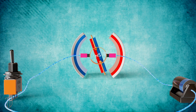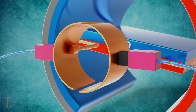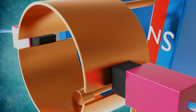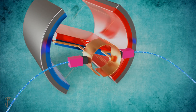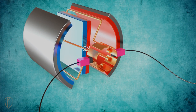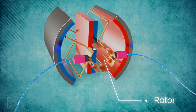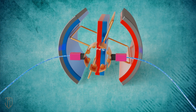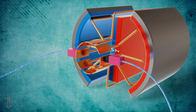That's how the armature is able to spin continuously, as long as it's connected to the battery. To up the ante, we split the commutator and add a second loop to the armature. These commutator pieces control the first loop, and when the brushes touch the other pieces, they control the second loop. Adding even more loops helps the motor spin continuously. The armature is called a rotor since it rotates — you can think of the rotor kind of like the crankshaft of a combustion engine.